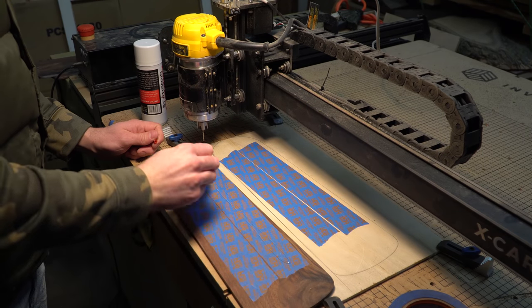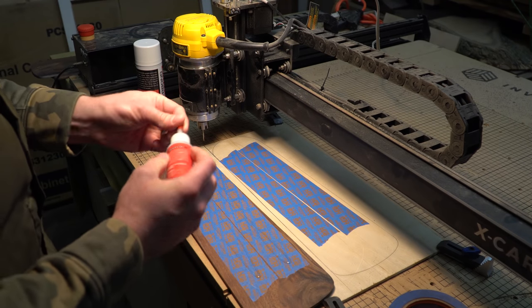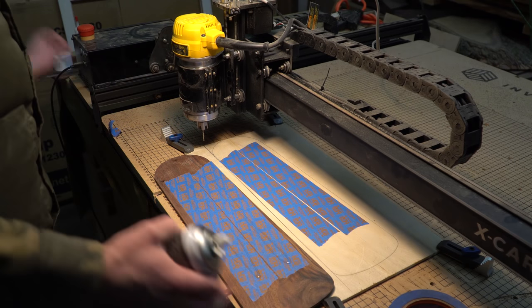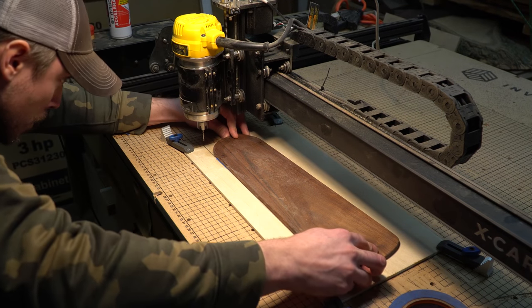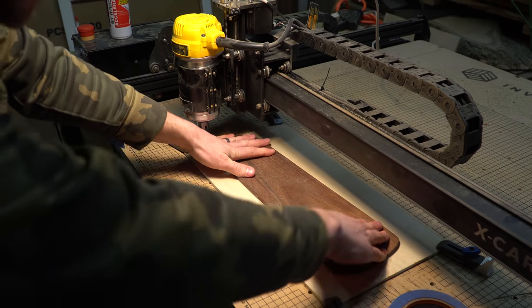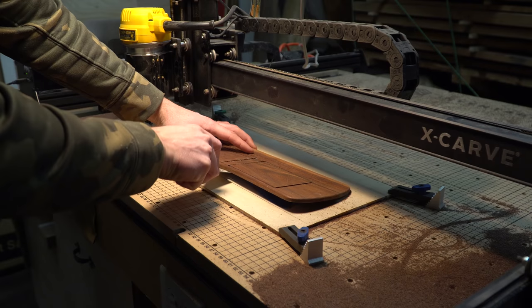First, you put blue, or any other easily removable without residue leftovers type of tape down, on both the faces that you want to hold together. Then, you simply put some CA glue on one side and spray accelerator on the other side before pressing them together. Within seconds, the two pieces will be bonded together strong enough that they won't move around, yet when it comes time to separate them, it's as easy as gently prying them apart, then peeling away the tape.